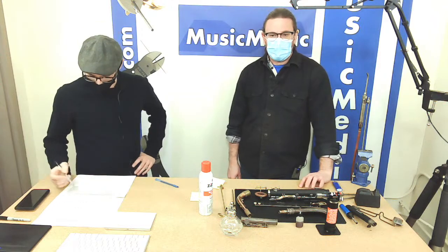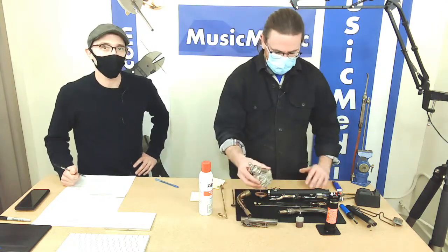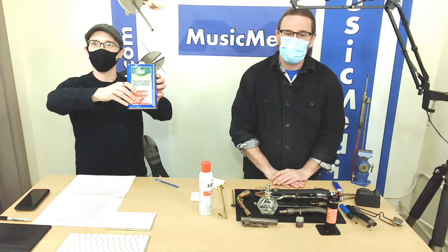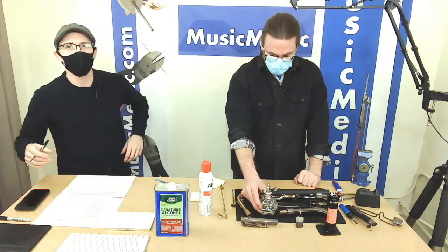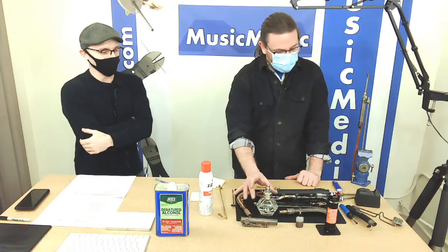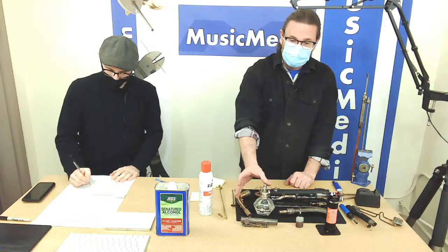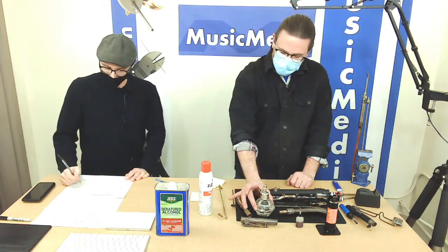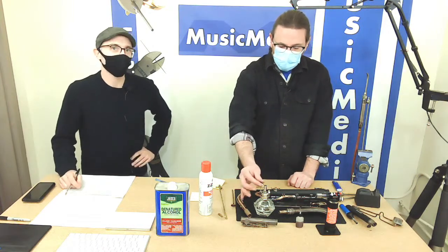A viewer question: for the alcohol lamp fuel, what do you normally use? Normally you would use denatured alcohol — they sell this as clean-burning torch fuel. People ask if you can use rubbing alcohol: if it's a flammable liquid you can use it, with some exceptions. I would not use lacquer thinner, jet fuel, or gasoline — those are a no-no. Stick to denatured alcohol. Another tip: in a pinch you can use grain alcohol like Everclear because it's a flammable, clean-burning liquid. But denatured alcohol is your safest bet — and make sure you cover it up when done.